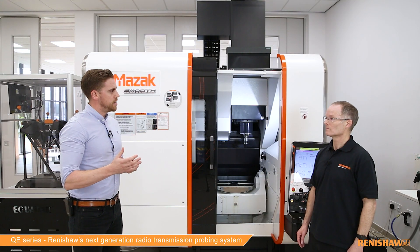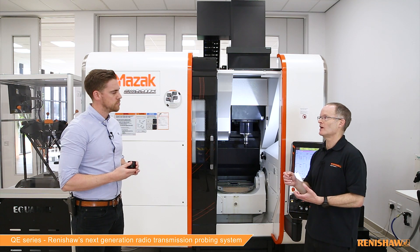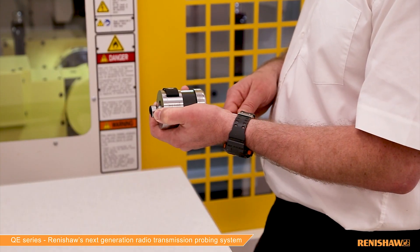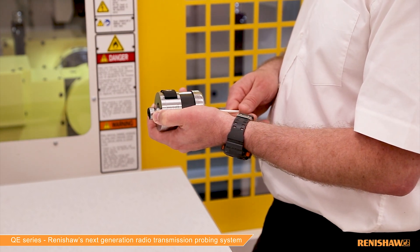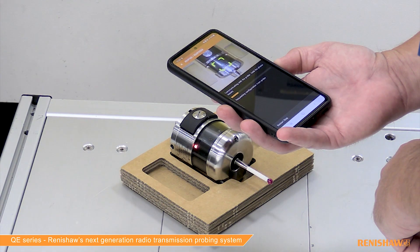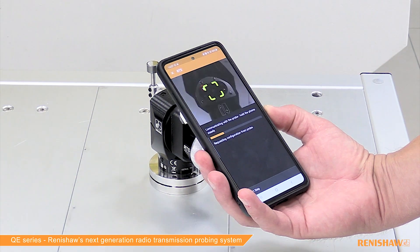You also mentioned improving probe setup. We've got a manual method at the moment, so I know this new technique is a big improvement. Anyone who's used a Renishaw probe before knows you do need to change the probe configuration — for example, if you're using a probe in a high vibration environment, you need to change the filter settings. Currently, this is done by moving the stylus when prompted by flashing LEDs on the probe, which is quite a difficult process. What we've done is come up with a much easier way using your mobile phone: you load an app, set up your probe configuration on the phone, and then use the camera's flash to send the new probe configuration to the probe.